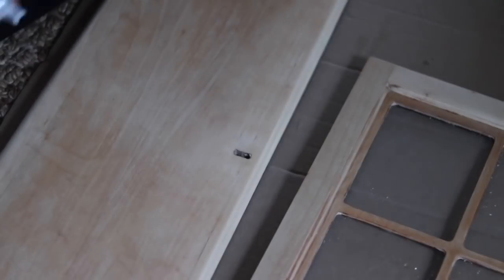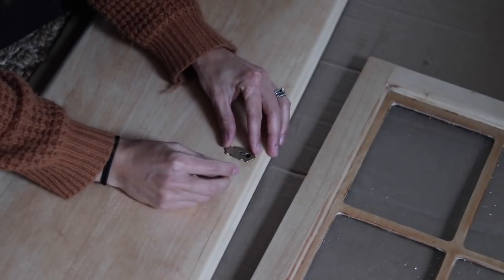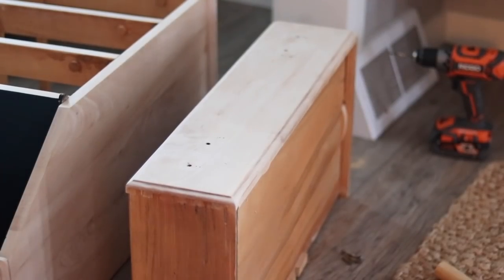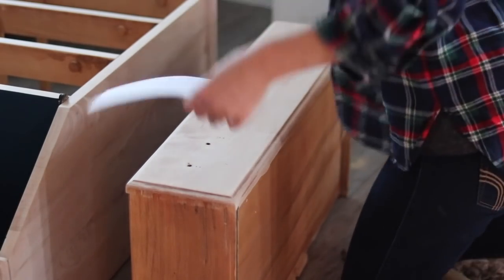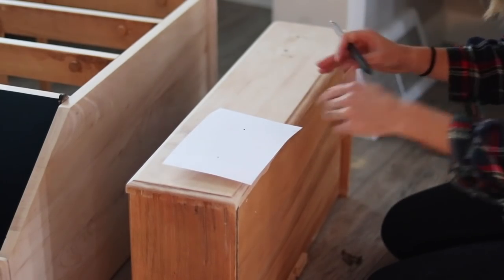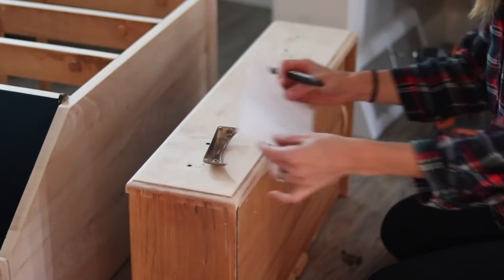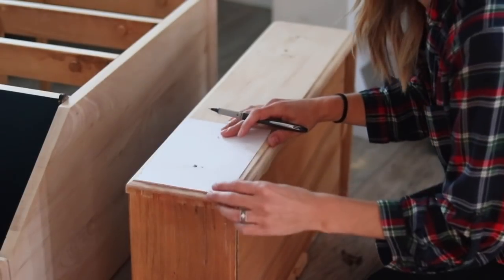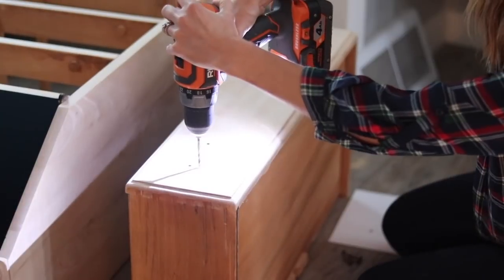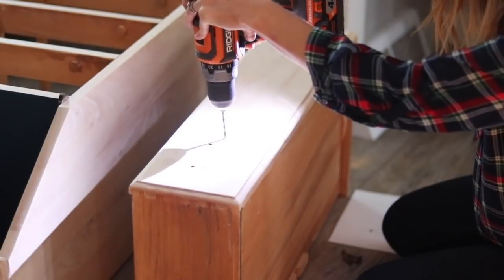The little metal piece covering the keyhole that I had cut down needed to get glued on, so I used E6000 and clamped it into place to dry overnight. This was necessary because before it had little holes where the nails could go in, but after cutting them off, gluing was my only option. Now it's time to attach the new vintage arch handles that I painted, which are going on the front of the drawers. I had different spacing than the existing hardware — the old hardware was 3 inches and these were 4. I made a template with a piece of paper, poking holes into the handle, then laid that paper evenly spaced on the front of each drawer to mark where to drill my holes. This was a very easy way to make sure the holes were centered and level. I also placed the holes so that the vintage arches covered up the old hardware holes and I didn't need to fill anything with wood putty.